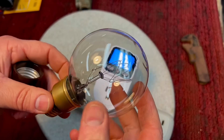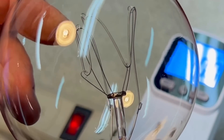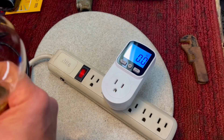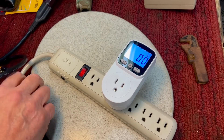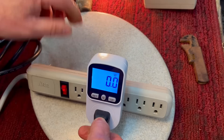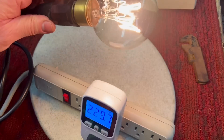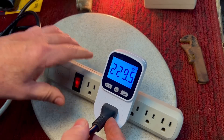Let me show you another use. I do a lot of light bulbs and this one was unmarked. You can see the thickness of that filament — it's a thick, heavy-duty filament and it's going to draw a lot, but I don't know how much. I'm going to put it in an adapter and plug it into an extension cord over here so you're not blinded by the light. Let's see what wattage that heavy-duty bulb has. We plug it in and look at the wattage — this thing's pulling 229 watts! Yet it only has the equivalent brightness of about a 40-watt light bulb. See something like that — you might say it's not that bright, so it's not using much juice, but it's using 229 watts.